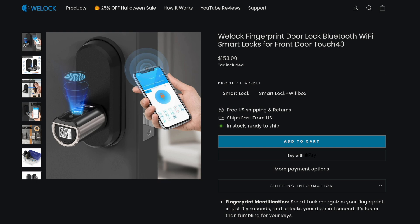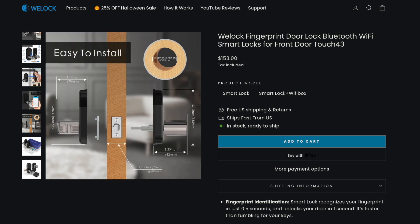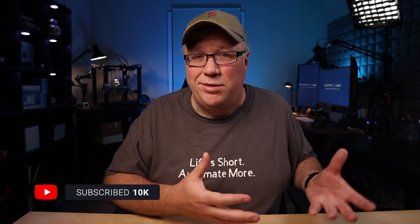The Touch EBL43 is a smart lock, and while I have no issues with smart locks in terms of security, I did have some requirements before adding one to my home. The major one being that it needed to have local control. I don't care if the lock has a cloud component, as long as I can control it directly locally — because for security devices, I need to be able to control them even if the cloud service or internet are down. The Touch EBL43 is a Bluetooth lock and can operate completely locally without an app or the internet, which may be the best thing about it. With the recent updates to the Bluetooth integration in Home Assistant, I was hoping to integrate this lock with Home Assistant completely locally as well. Turns out Home Assistant still has no direct control of this lock over that integration. You can connect it to an Amazon Echo and use that Echo as a bridge between Home Assistant and the lock, but for me that turned out to be problematic, which we'll get into later. But as a standalone biometric lock, this one is pretty decent.